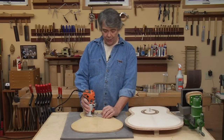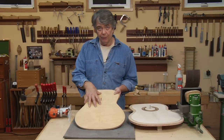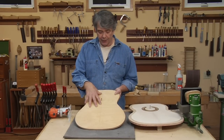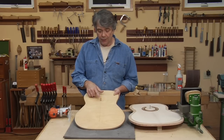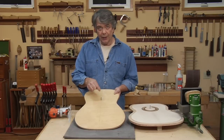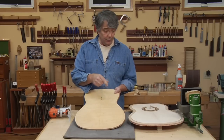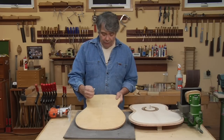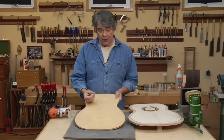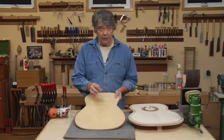The attachment fits in this hole and you can adjust it in and out to make your cuts. If you're going to cut more than one rosette on your workboard, you might want to consider using a metal bushing in here. The metal rod will wear the wooden hole out and you'll get some wobble, which will translate to an uneven hole. If you first drill this bigger to fit the bushing and then put the metal rod in the metal bushing, it'll stay tighter longer and you'll get a lot more use out of it.